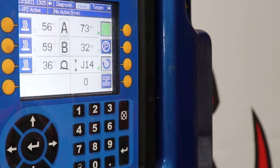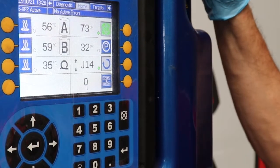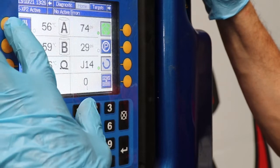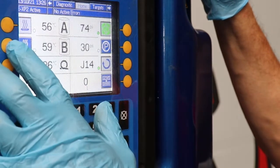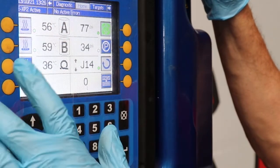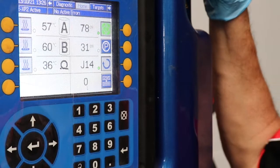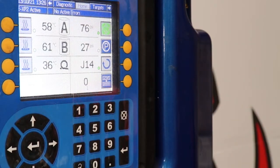We want to work that heat up a bit more. Once it gets to the operating temperature — ISO at 65 — we'll go back into our temperature settings, bring them down to our running temperatures, and go from there. To turn the heaters on, press the two buttons here: one for our ISO and one for our resin. You'll see two green lights, which means they're working and activated. We also want to heat up our hoses, so turn that on as well — it's set at 65, which is our running temperature.